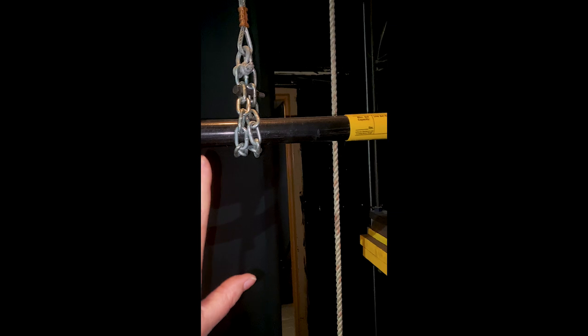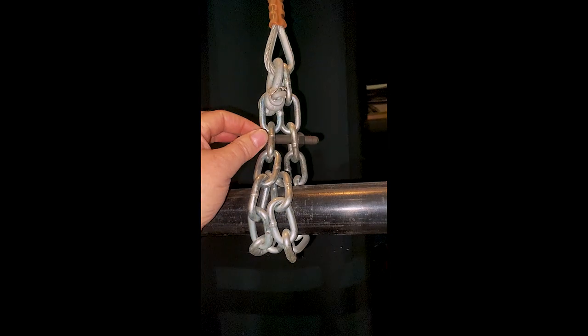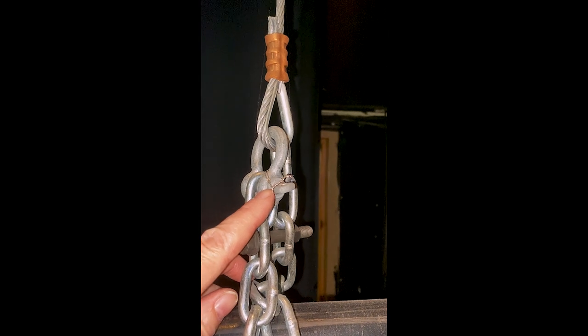The last thing you want is for it to come in at an angle, because as it reaches the grid it has to shift and becomes an extreme angle the closer it gets. The chain wrap makes for an easy left-right adjustment to get that angle correct. But if you're near the end of the pipe, you want to put in a keeper bolt that pinches the chains together so it has no chance of slipping off the end. Even this distance looks extreme — being under a foot from the end of the pipe, I want that extra bolt in for extra safety. And here you can see a nicely wired mousing of the shackle.